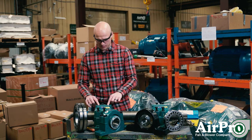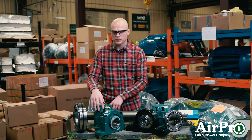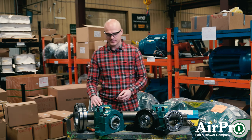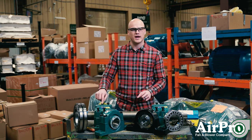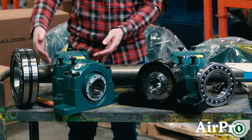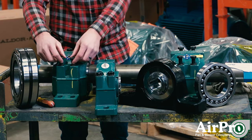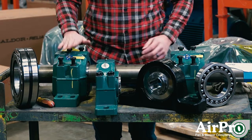The first type we're looking at, where the shaft is within these two bearings, are four-bolt split-pillow-block grease-lubricated roller bearings. You can pop the caps on these and they're sealed on both sides. The specific type we have in front of us is the Dodge USAF type, and these are always going to be split-pillow-blocks. In the bearing housing, it's split halfway up, you've got four bolts running through — you can pull the bolts out, pop the cap, and get in to access the bearing and the grease inside.